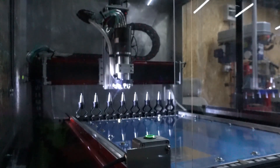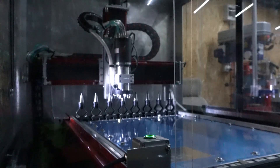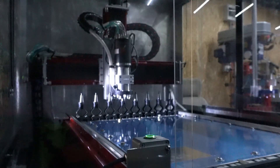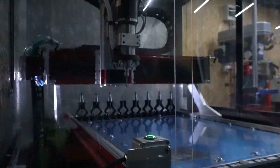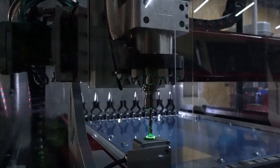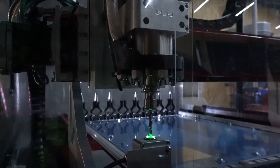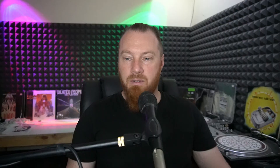The 3D printed rack deforms slightly while the spindle moves 1 or 2mm further down than the tool resting position. The 3D movement compliance in this design makes tool changes reliable and easy to program in, as the coordinates are the same for each with a 40mm increase in the x-axis for each position. One improvement I have planned is to make an elevated tool rack that can be moved away from the machining volume — initially a manual task, but I may automate it with servos or pneumatics.